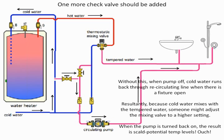So we've got to be very careful with our sizing. Sizing has to be proper, very low flow through there. So we don't want a high flow rate through there. Otherwise, it will increase the erosion corrosion in copper tube.